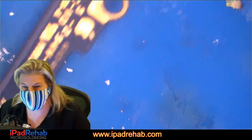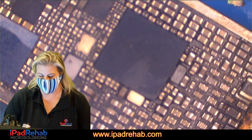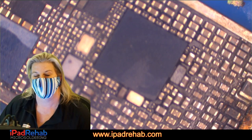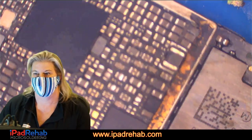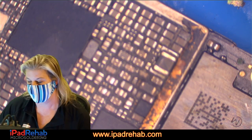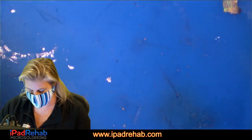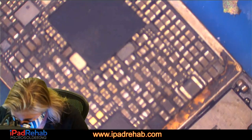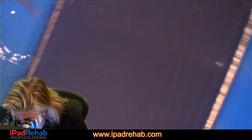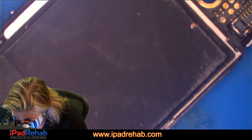Damage there. All right, so what we have, that is our complete visual exam. And what we have here is a water-damaged iPhone 7 Plus that's never been in an ultrasonic cleaner. It's never actually been cleaned, but somebody has knocked off this fairly common VCC main cap at the end, and that's pretty much it. So, step number one for us, we're gonna have to give it a bath, and I think there's probably a good chance that we may have some corrosion under here. So I'm gonna take this shield off.